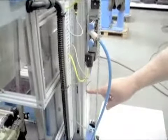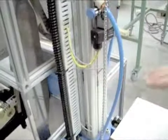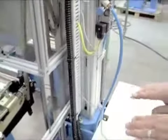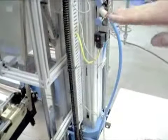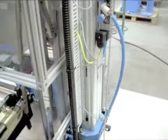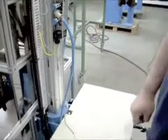The first sensor: when the wing is going down, you want the rollers to come in right at the spine of the book, or an inch or so above the spine. The second sensor, with the scale, you set to the length of the book — or the travel — so that the rollers open up just before the rollers reach the end of the book, by anywhere from 10 to 15 millimeters.